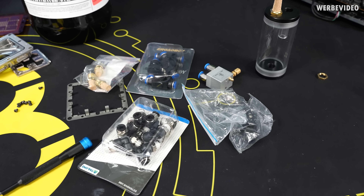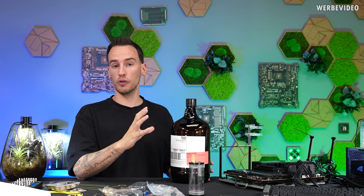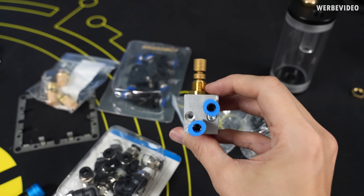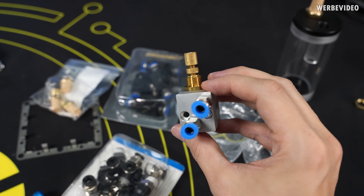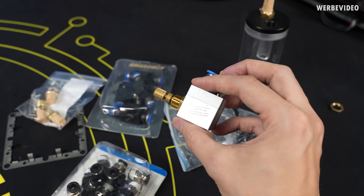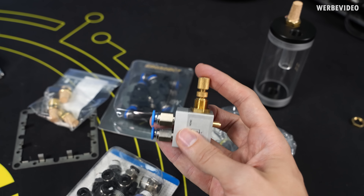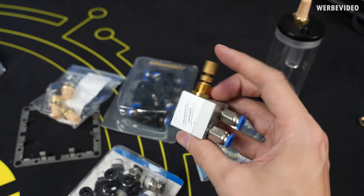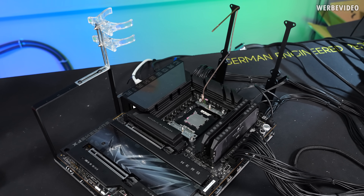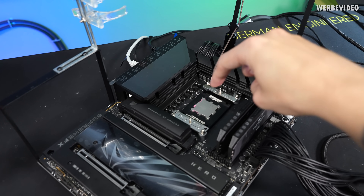For this spray cooling experiment I ordered a bunch of pneumatic components. I won't be able to implement full condensation and recirculation, so I'll focus just on the spray cooling part. I bought a small pneumatic atomizer with two connections — one for air pressure and one for fluid from a simple reservoir. Through the Venturi effect the fluid is pulled in and vaporized through the nozzle on top. The system uses the 9800X 3D with a small arm mounted for the reservoir and atomizer, which should spray down directly onto the CPU and cool it.